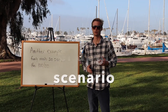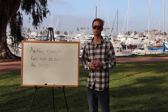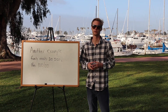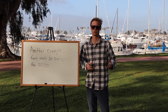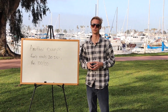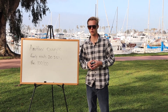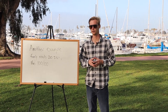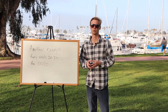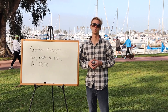Here's a real-world example. You show up to a house, the family has a 100-amp max main breaker and 100-amp main service, and they need 20 IQ7s. In this case, we're going to upgrade it to a 200-200. If we redo the math, a 40-amp PV breaker is the maximum that fits in that box, which means we can fit 32 IQ7s onto a 200-200 panel.